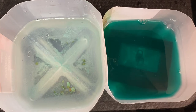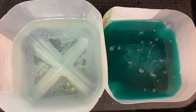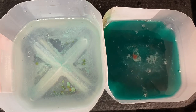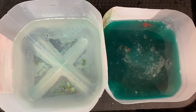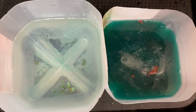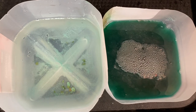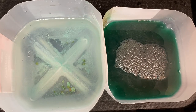Right away you can see it start to cloud. You can see the aluminum surface start to darken. The etch starts to darken and you get all these bubbles that come up. I would leave it in there for about a minute, but within seconds you're going to see some of the sludge start to lift up. There it is — this red sludge. If that gets too thick, it's going to block your exposed metal and it won't be able to keep etching. So make sure that you continually rinse that piece off. As it fizzes, those small tiny bubbles will start to form a foam, and the more the mix darkens, the bigger and sludgier that foam is going to get.